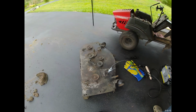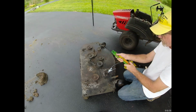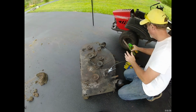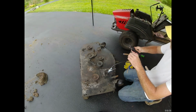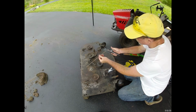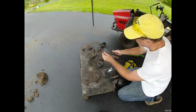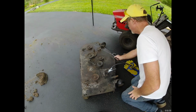Now, open up these rods. I'm gonna leave them open. We're gonna need several of them. Go through the rods pretty quick. Power's off right now, so it's safe to go ahead and clamp this in. Just the rod. This is pretty thin 6013s and kind of an all-purpose. 6011s will work too, but this is a small welder, so I'm going with some lighter rods.